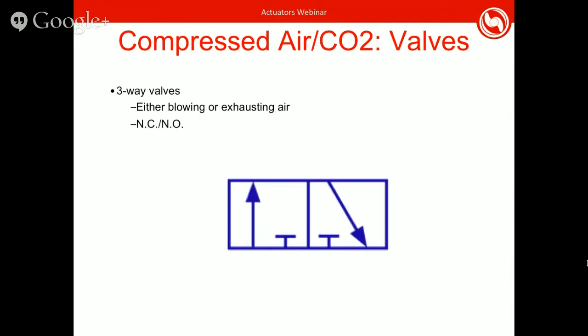There are also three-way valves. With three-way valves, you can either be blowing or exhausting air. One thing to know with three-way valves, if they're two-position, you cannot just have no airflow through them. Basically, your paintball tank would be connected to the output so you're blowing air, or your outside air source is connected to your exhaust, venting air from whatever the valves are connected to. You can have them normally closed — venting air — or normally open — blowing air from your paintball tank.